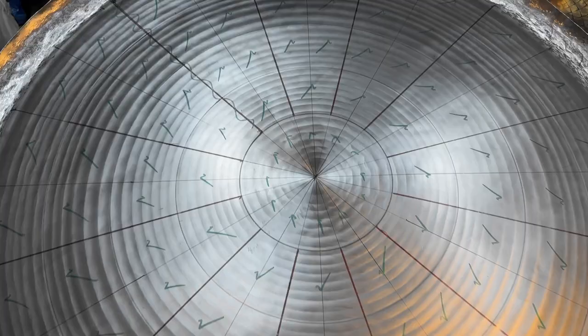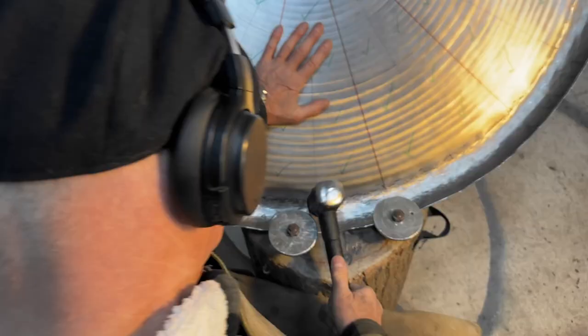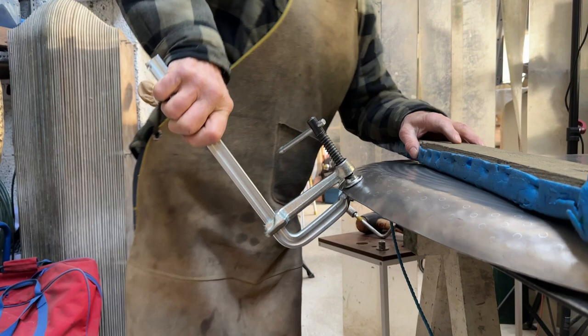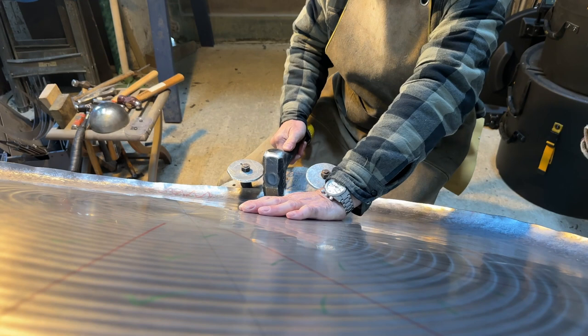So the next challenge when you've got your giant Pringle is to try and hold that tension in place. And you do that by creating this rim. And again, this can take a few days, literally, hammering and then putting it on a flat sheet to see where the bendy bits are. Coming back, more and more hammering, back on the flat sheet, more and more hammering.